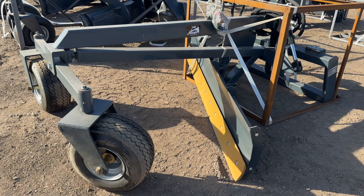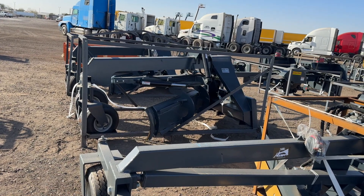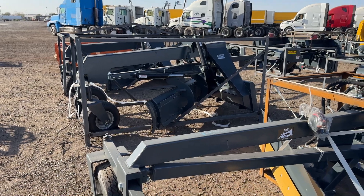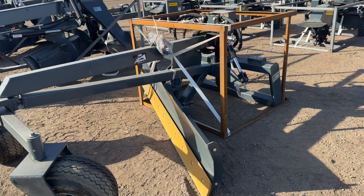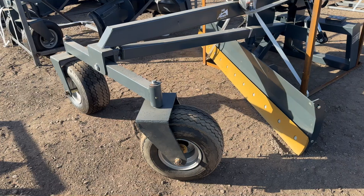Here's the handy light-duty grader — there's the heavy-duty one there. It looks like the bigger Bobcat model; you can tell by the way the frame is on the top and the way the cylinders drop down. On this one, the cylinders are trailing behind at the very back. It's got kind of a slot in there, so it's a much cheaper, lighter-duty grader.